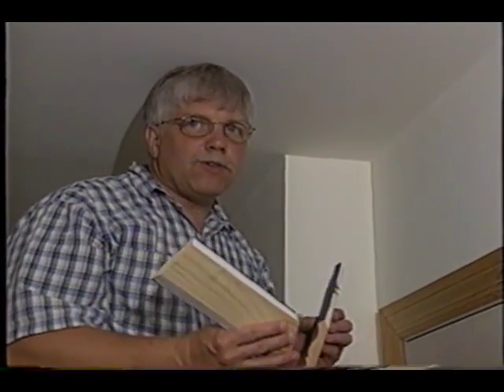See how these test pieces fit? Let me tell you another advantage of using them — they help you avoid waste. Go ahead, cut your test pieces, make sure you understand the relationship, put them up on the wall on the ceiling. Once you've got it down pat, then you're ready to advance to the big, long pieces.